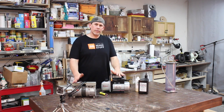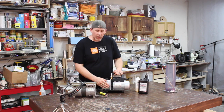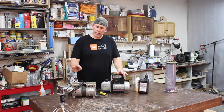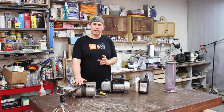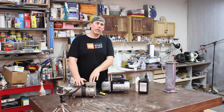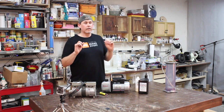I want to talk about the difference between these oil-less ones, which is what I had before, and ones that run on oil. This one is a lot louder — that's just one effect of oil-less motors. But this thing can only pull up to about 24 inches of mercury, which is the number you're really looking for when it comes to vacuum pumps for stabilizing. That's really the only spec that matters.